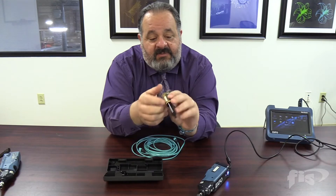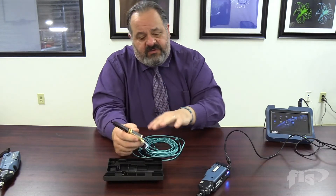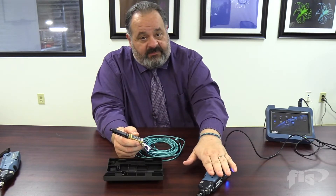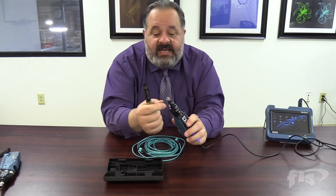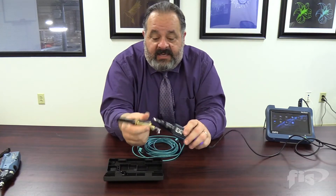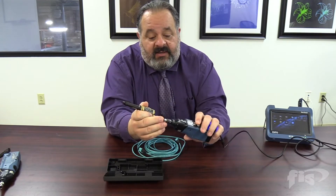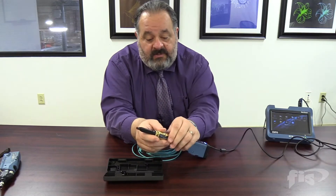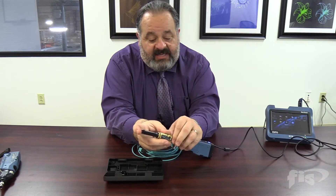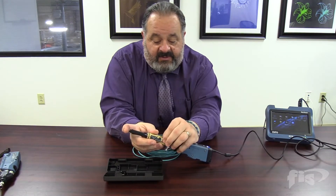This is their MPO probe tip. When you do MPOs, you're going to have to get the microscope and get this piece here. What we do is take off our normal tip — there's a little notch here, and there's a male and a female version. We push down on that notch, slide this collar up, and screw it into place to attach the adapter.